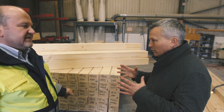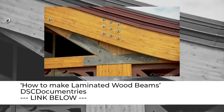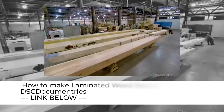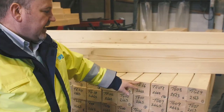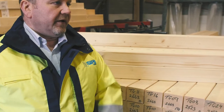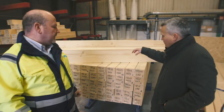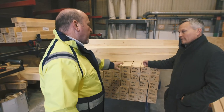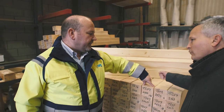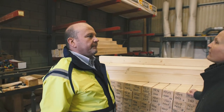From the side drawings on elevation TG08, it'll show a post dimension that the team retrieve from the pile. These structural posts go in between panels and you'll never see them once it's built. Wherever there's a door or window, you'd always see one on each side — forming the jambs. The head is a 240mm timber, or if it's a bigger opening it might be a glulam beam.